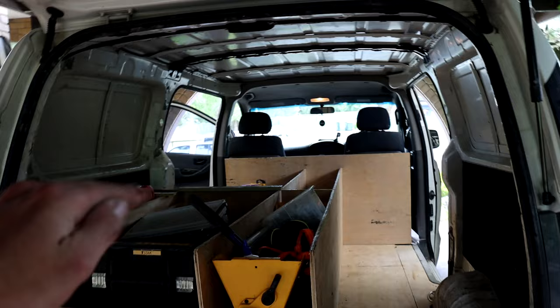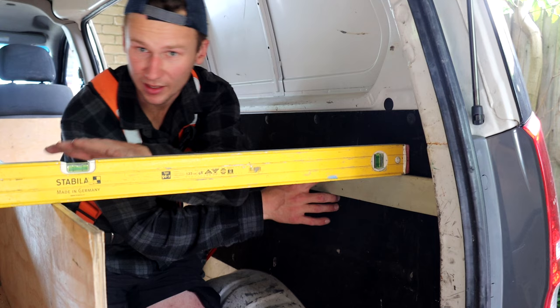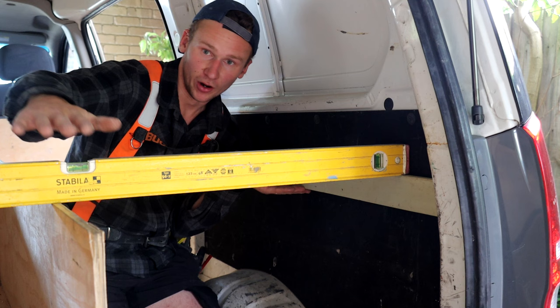We've got this middle section and I'm missing my levels — missing a 600 or 1200. My first little track goes through there, Dewalt bench and everything goes through here, but this isn't secured yet either. I'm not actually using the level to see if this is level — my van's never going to be level. So I've already got these two points flat in a straight line, and I'm just sitting my level on top of all the other ply to get that straight line running across.